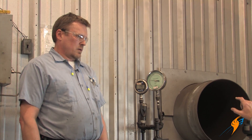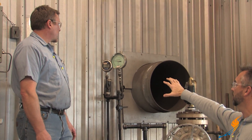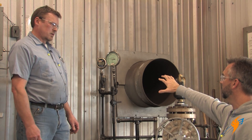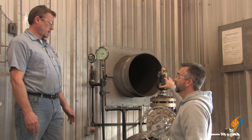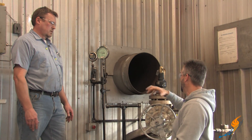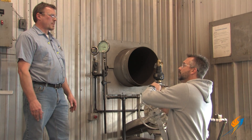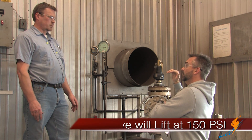So you've got the gauges — what do you have them set at, the pressure for the boiler? As of right now I have it about 129 PSI. We've got our relief valve set on the stand at 150 PSI, and I'm assuming the way this works is that you're actually going to raise the pressure and then it should lift at that 150. Yes, it should be 150.